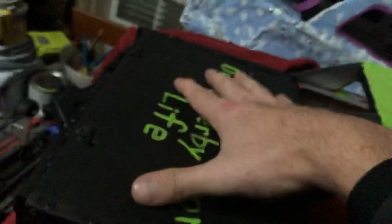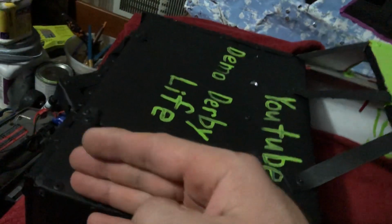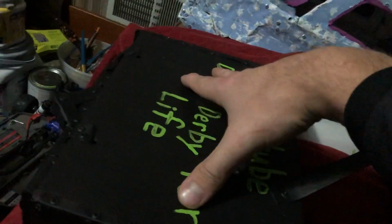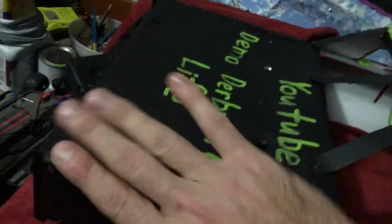So you'll have these here. These flaps will be rolled over. And also for the hood, you'll do the same thing. This is supposed to be 12 inches wide, and I want to do a 1/4 inch roll, so I'll do a flap. I'll do a 1/2 inch longer, so instead of 12, it would be 12 and a half. That way I can do the extra rolls. Same thing with the trunk and roof. You'll make that extra flap.